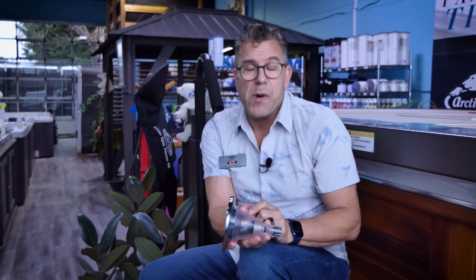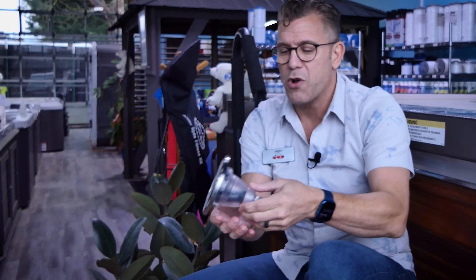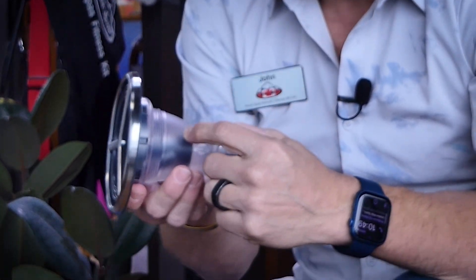Then there was a chemical product used in the United States called Baqua Spa, and Baqua Spa is a biguanide. Unfortunately, Baqua Spa breaks down polycarbonate, which we didn't know. It's a very small percentage of spas actually using this, and in Canada you can't use it, but in the rest of the world biguanides can be used. A biguanide sanitizer is like Lysol — they're part of a chemical family called Quats. Anyway, that material happened to break down polycarbonate.